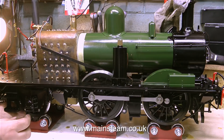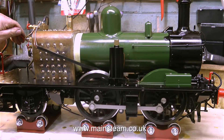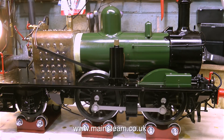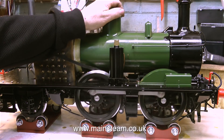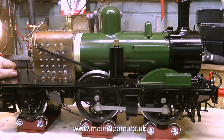So what's been achieved by messing about with the suspension and the rear axle? Now when I take the engine off and rest it on the bench, all the flanges touch the bench, and even though the wheel diameter is different on the rear wheel the flanges touch the rolling road as well. This appears to be a significant improvement on the original arrangement. The engine is starting to run very smoothly now, which it didn't do before. Thanks for watching and I hope you found it useful.